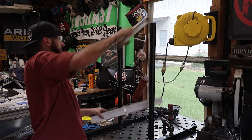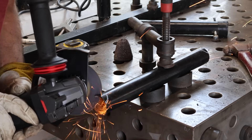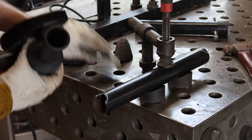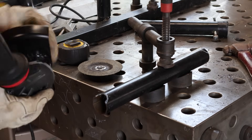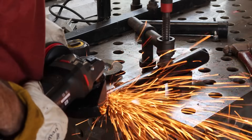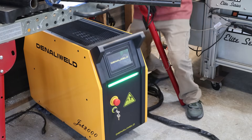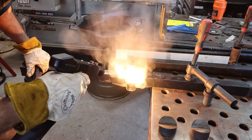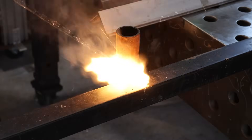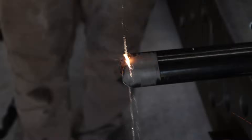This unit isn't very heavy so it's not a big deal. I'm going to cut the cross member and then notch it using a cutoff wheel to cut the majority of the meat off and then come in with a cone rock to clean everything up. Usually when you do a bunch of eyeballing you'd want to MIG weld something because there are going to be some hellacious gaps, but today we're going to crank up the laser welder. We have a lot of paint and rust on these hammock pieces so I'm going to do the laser cleaning. Make sure you have your laser-safe PPE on — it really does just vaporize rust and paint. It's a very satisfying process to watch.